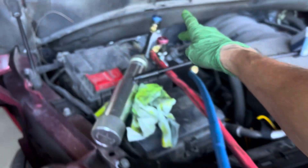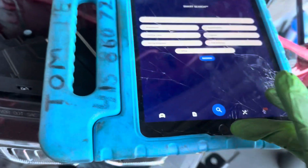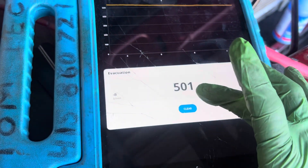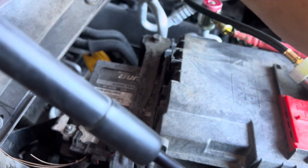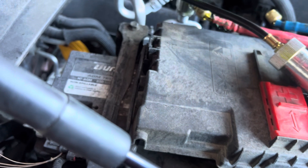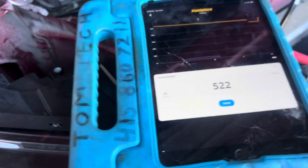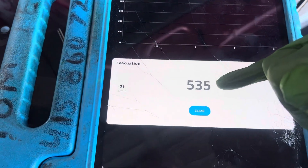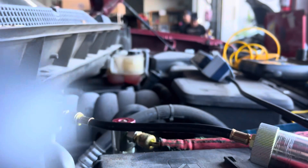I have the vacuum pump on the high side sucking vacuum - we're down to 466 microns. You're going to see it get lost a little because there's some entrained compressed air in the system. I already purged all the air out of the hoses all the way up to the tip. The system has been open to air for about a week, so you can already see it jumped just by me closing that off.